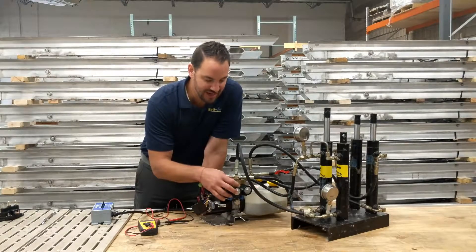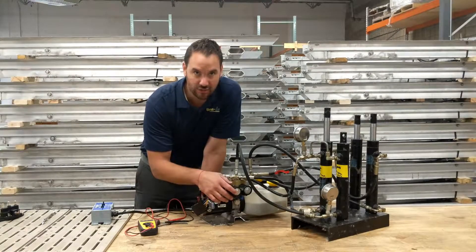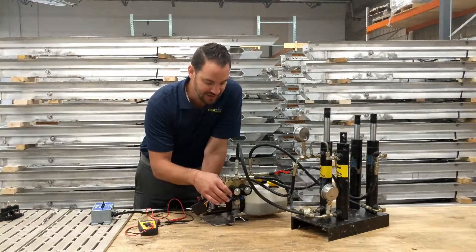So you can check or swap the coils to make sure it's not a bad coil, but simply testing for voltage would tell you if you have power coming in to the coil itself. If you have power and it's still not operating, more than likely it could be a bad coil — very unlikely, but it could be a bad coil.